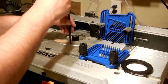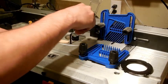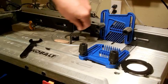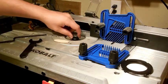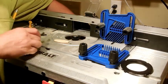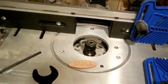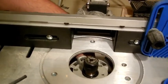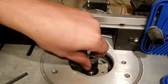If you've never used one of these before, my router has a little drop-down piece that will raise and lower the router up like so. So we are going to raise this up where it is accessible, and you are going to make sure that you have this already unlocked. You are going to use a wrench for this. On my router there is a lock button around the back side down inside. If you come right down under the bottom, that is my lock button, and I have to press and hold that while I use the wrench to tighten this.